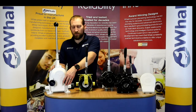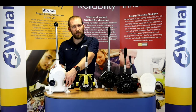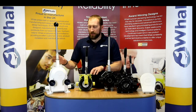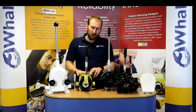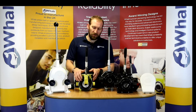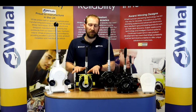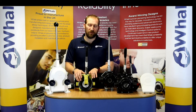The Gusher 30 — you can remove the front and rear covers to service or clean by hand, so you don't need any special tools. It is also rated as a fire pump, as well as an emergency lifeboat pump. The Gusher 10 is much more simple, and it can be installed on a bulkhead, on the floor, or through deck as well.